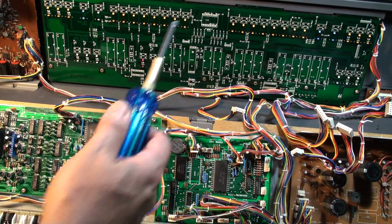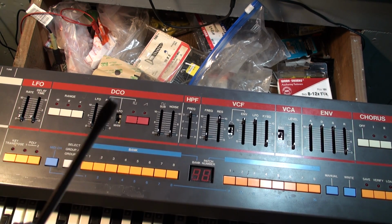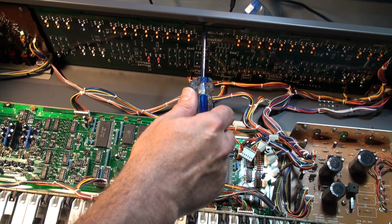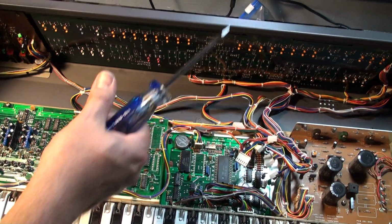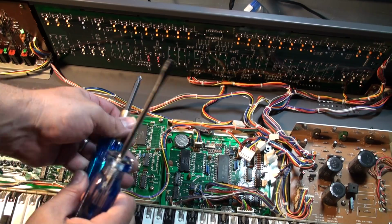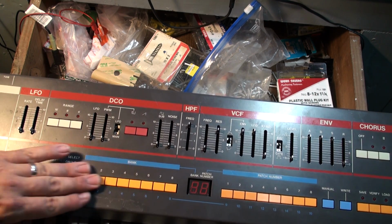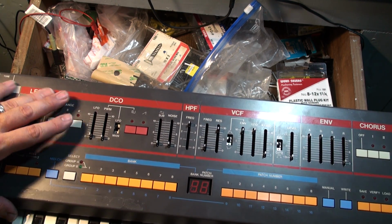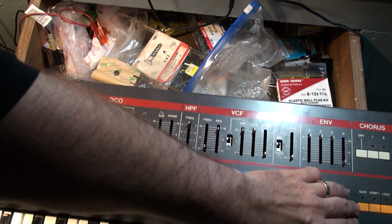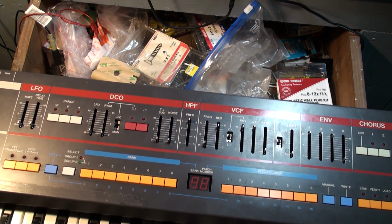And you know, on some metal work cases and some panel board combinations, I have found that I really had to use this trick here with the screwdriver up against the slots in here to basically twist it, get it down a little bit, twist it, get it down a little bit, and you know, sort of loosely tighten them, and then get it down, and then tighten it some more, and then reevaluate. It is a bit of a to and fro, a bit of an art job, but as you can see, when you're done, these guys are in, they're lined up. We don't have an overlay to use as a demo to show that you don't have any binding, but look, nothing is binding on this one. And so that's it. That's the front panel in place.